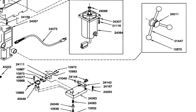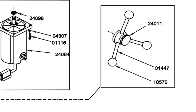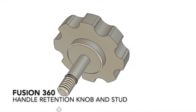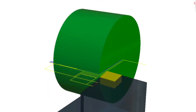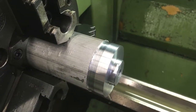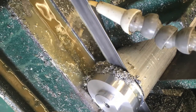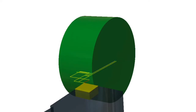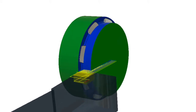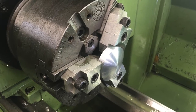The retention knob for the handle was missing. I looked up this part number — 24-0-1-1 — and they were asking $67.50. I figured I could make one. I turned it from the aluminum bar stock that I had used for the arbor to hold the spool. I then removed the bar stock from the lathe and cut it off on the bandsaw. For the second operation on the CNC lathe, I turned the domed surface of the knob to make it look nice — and it turned out pretty good.